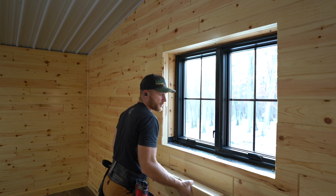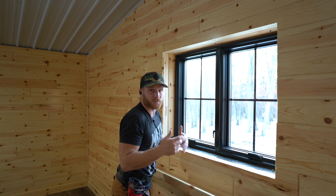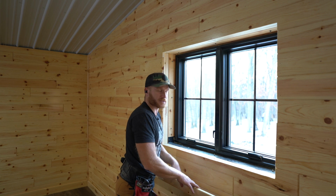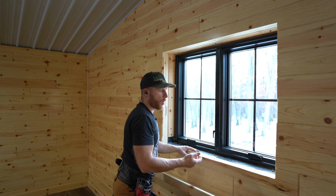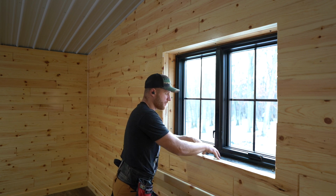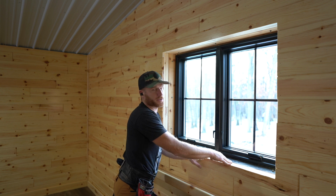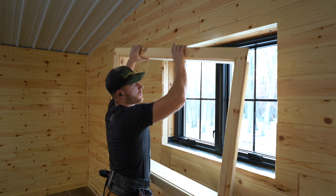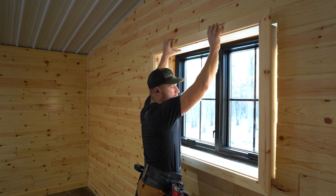All right, so now that I've got those screws, maybe it makes sense, instead of using a shim that you can't adjust after you put this box in since it covers everything up, or pre-assembling all the shims and getting them perfect, this is way easier. You set the screws to the depth that you want, and use the head of the screw like a shim.